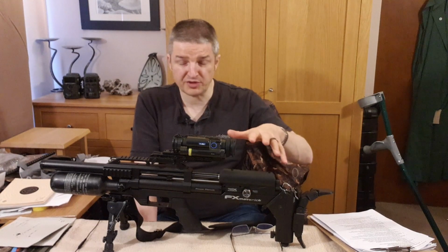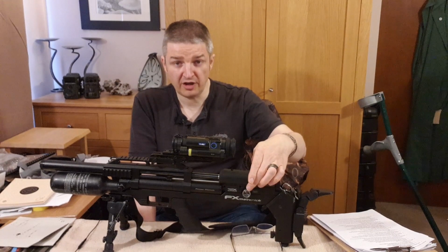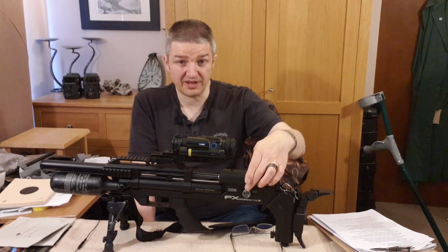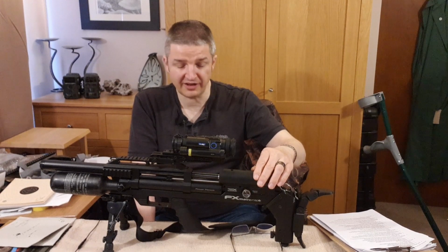I went through that procedure I've just described to you, repressurized the system up to 50 bar, chronoed it, and the first time it chronoed at 798 feet per second average, and the legal limit is 799 with the 8.44 grain JSBs, so it really was as high a legal limit air gun as you can get.